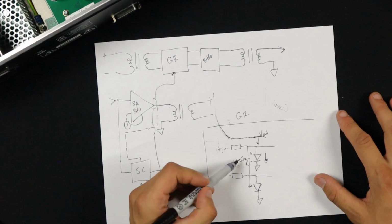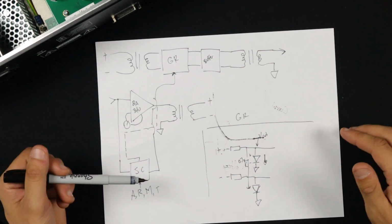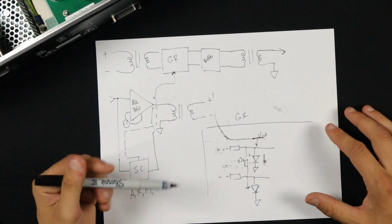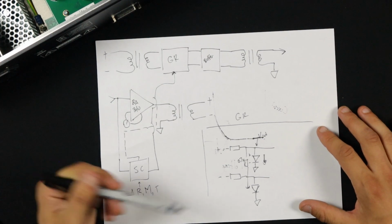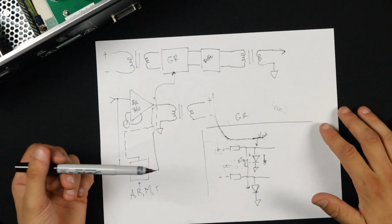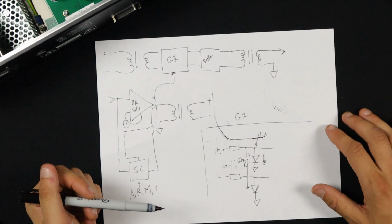One is that, if you exceed this 0.7 volts, these diodes are basically just clipping diodes. You could really use this as like a distortion pedal if you gave it enough signal. So, FETs and optos are also going to have a point at which they clip, but it'll be a good bit higher than 0.7 volts. So you're more likely to get that with this kind of compressor. Another is that these diodes need to be very well matched. Otherwise, you're going to have some funky asymmetrical compression between the two halves of the balanced signal, which will look like asymmetrical distortion, which could be cool.